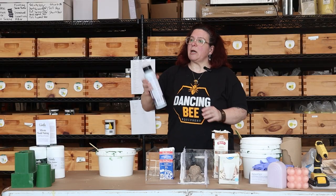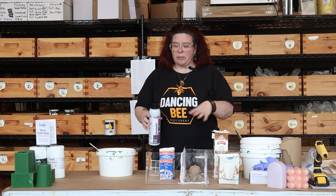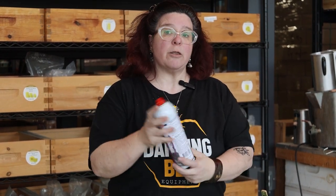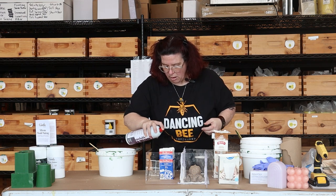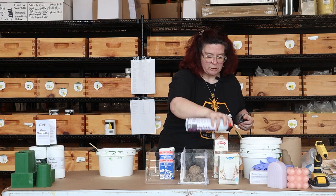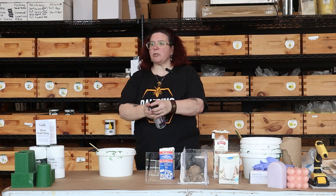So remember earlier I mentioned that we want to coat with some mold release. This will help if there are different porous materials, and it helps you, especially the first time, pull your silicone away from the model, okay? And when I say model, that's simply what we're using to cast the mold. So I'm just going to give a quick coating of each of the models, inside and on the outside, to help release the mold, okay? You don't want to do too much.